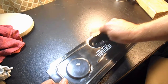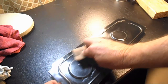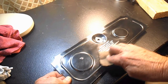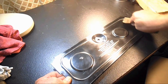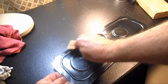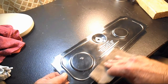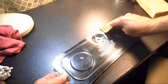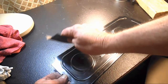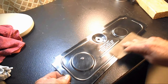Underneath a lot of it was rust — little rust spots in the steel — so I've just been sanding away on this. Once I get all the spots smoothed out and the corrosion off, I'll be putting a new coat of black paint on here. I'll do some highlights of that painting process, but basically just sand it, make sure all the sanding material and debris is off, wipe it down with denatured alcohol, and then spray it with a high-quality gloss black spray paint.